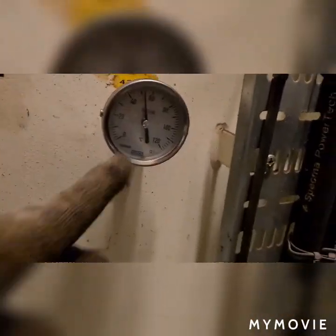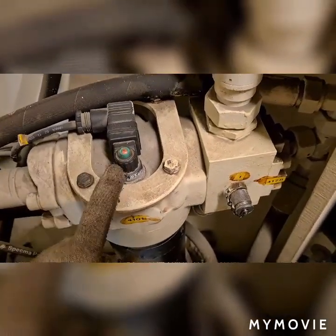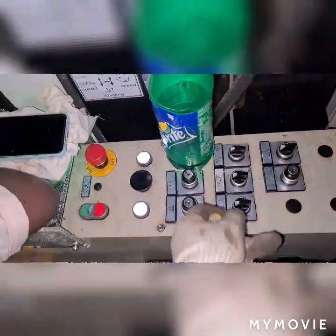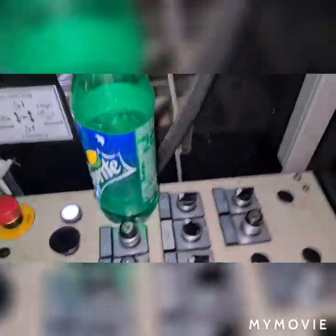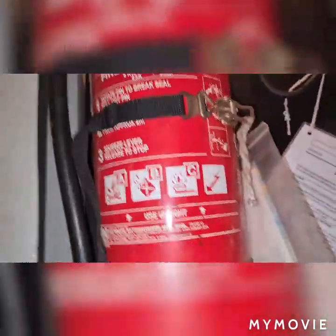Normally the crane hydraulic oil temperature is set within 65 degrees Celsius. This is our hydraulic oil filter and this is my temperature controller. From here you will find the crane operator with me, and while the crane is working we check and monitor what alarms come in. We need to assure that the crane is operational without any alarm or defects.